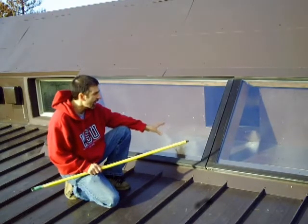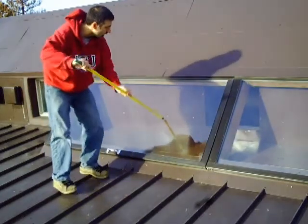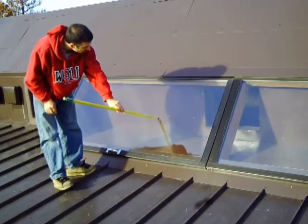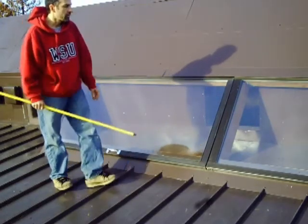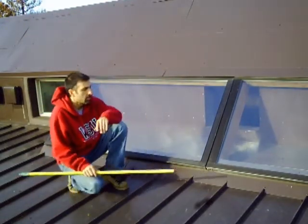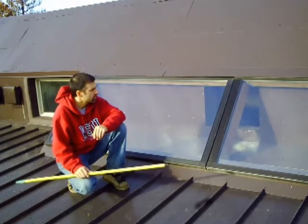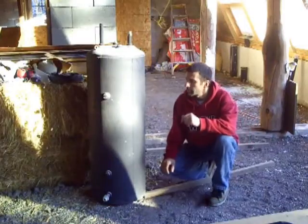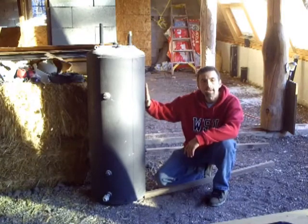These panels are at a 45-degree angle, and this is double-pane insulated glass. At 45 degrees, the tank is going to be right in the middle — we're going to get the winter sun at the winter solstice and the summer sun at the summer solstice. 45 degrees is really the best angle for a batch heater in general, and that's about the best angle for this location specifically as well.